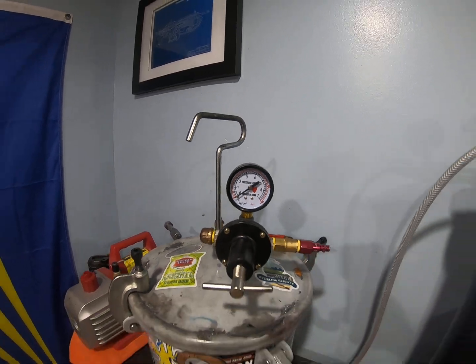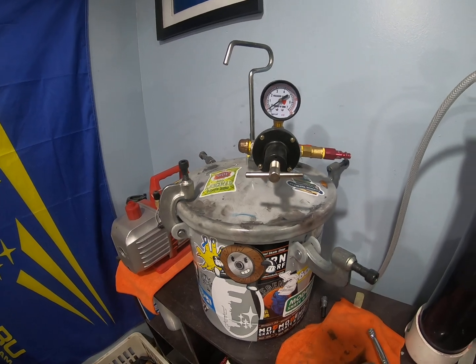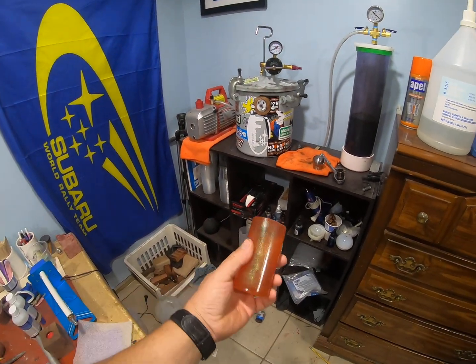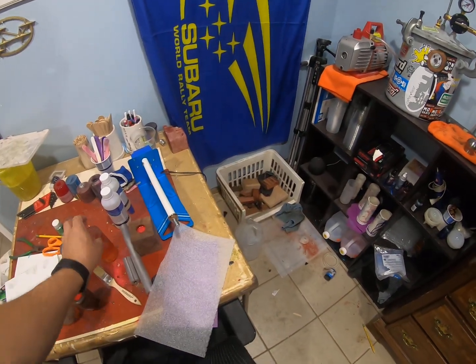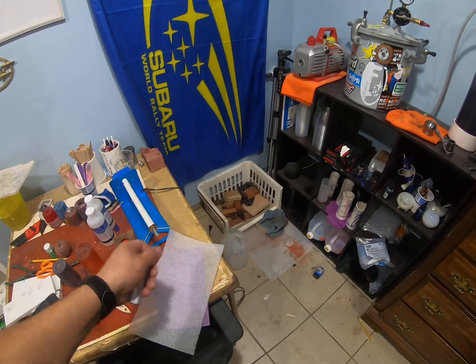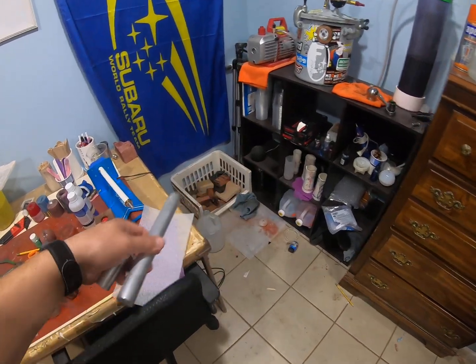That has to sit for at least 24 hours to hard set, and then 48 to 72 hours to fully cure. Once it is fully cured, it pops out of the 2-inch PVC mold like this as a weird rough kind of cast. I then have to create an insert, an aluminum insert for it, which I use 1-inch round aluminum bar, rough 6061 material.